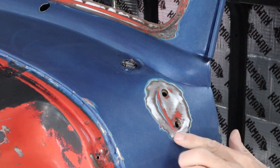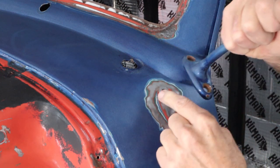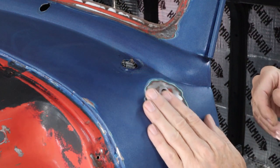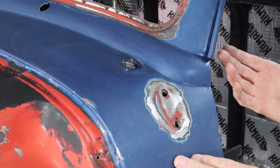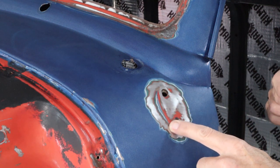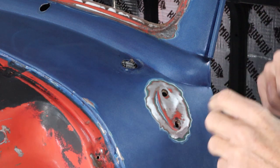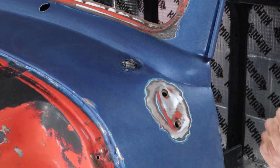Since there's so much paint on here it feels low, and if I put a straight edge across there it's quite a bit. So I'm going to go ahead and remove all the paint around this — it's cracked anyways from me pulling on it. We've got to weld this hole in anyway, so that's going to be ground away. I'll probably just grind to this body line and feather this back to get the paint off to make sure we get this sheet metal nice and flat. As you can see since we ground it, it's looking really good over here all the way around except for this crescent dip right here — that's where the mirror was wrenched over and it cantilevered right in there and put a big kink in there.